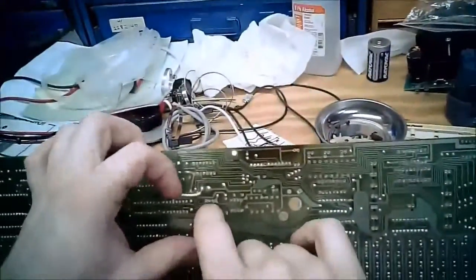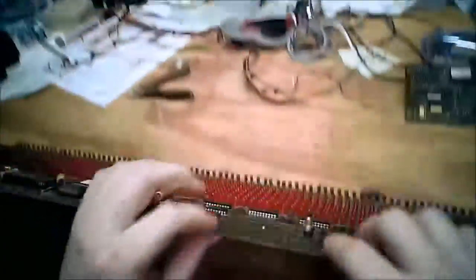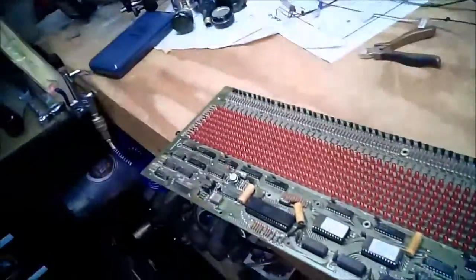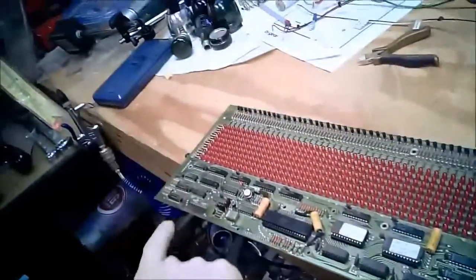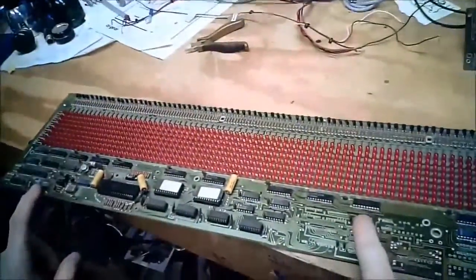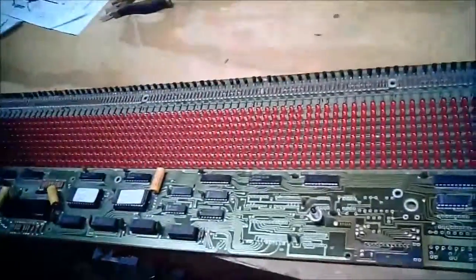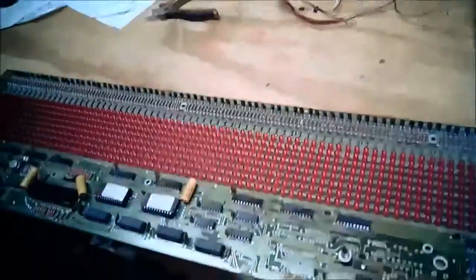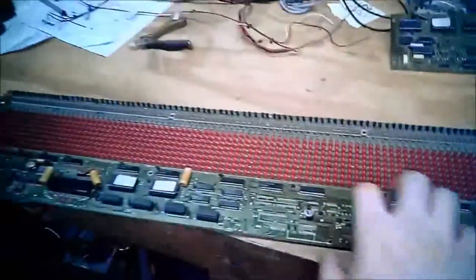But anyways, what I just learned is this switch is tied to ground, and it's part of this keypad input mux. So somehow it is smart enough that when you push this button down and short the works out, it can tell the difference between this button and pressing buttons on this keypad. But either way, he can go away. He's part of this keypad key press circuit, and I don't have that keyboard. I don't really want to use this button for anything, so it can all just go away. Since he can go away, he can go away as well. And I think that's the end of this corner here.